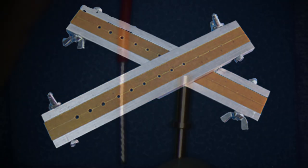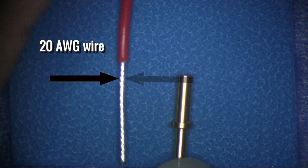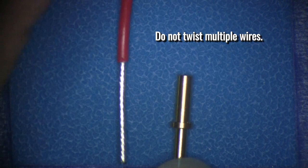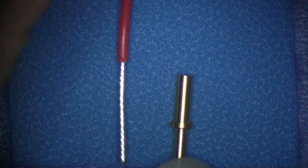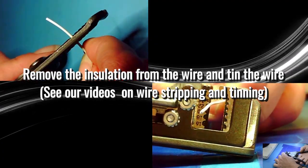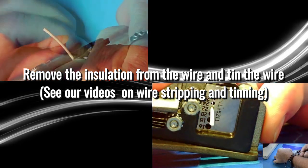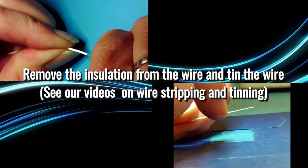Select the appropriate gauge wire for the terminal. In this case, the wire is a 20 gauge wire. The wire should not be altered to fit into a small solder cup. Likewise, the cup should not be altered to accept an oversized wire or wire group. If multiple wires are used in a terminal, the wires should not be twisted prior to insertion. Strip and clean the wire to a length sufficient to insert the wire for the full depth of the terminal plus a little extra. The extra length of wire can be trimmed to the final length after the wire is measured for the terminal in use.